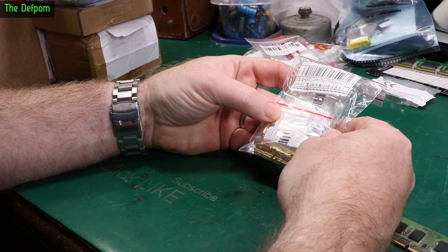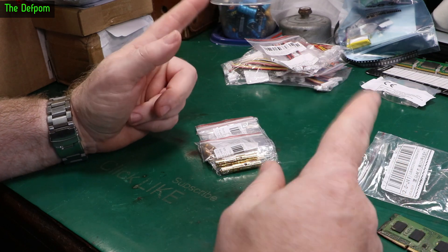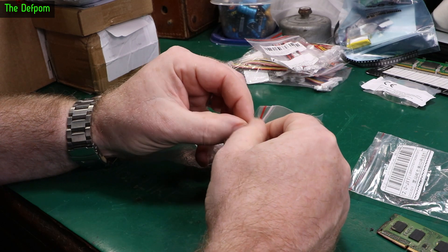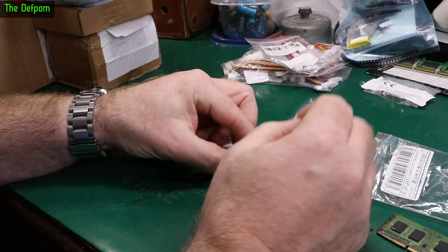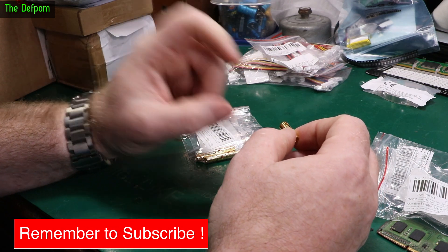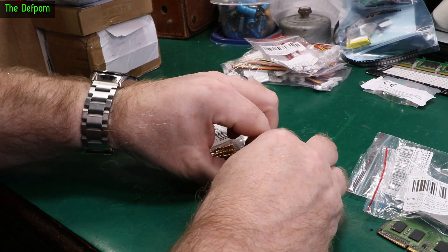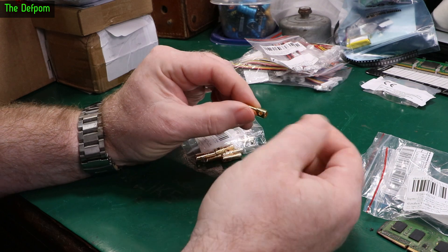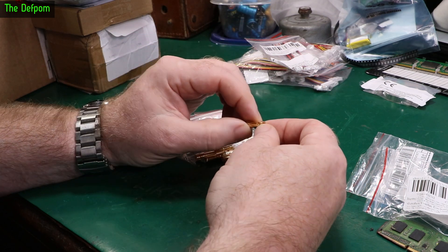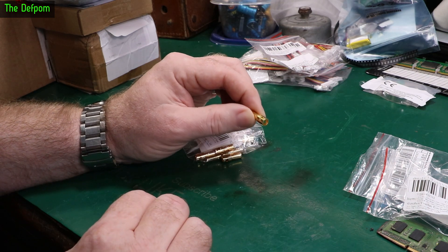Hopefully these are the right things — let's find out. Now these are needed for a bit of a weird situation. I've got a piece of test gear which I've done videos about — it's a capacitance standard, like a decade capacitance thing. It's got sockets along the front and they're not four millimeters, they're 5.5. They're actually shorting plugs, so when you plug something in, it shorts the terminals inside and adds that capacitance to the output of the unit. I had no plugs for it, and I think these will fit. Yes, these do fit — these plug in beautifully. The only problem is the sockets are quite recessed, so when I push this in it disappears behind the faceplate and I have to use tweezers to get it back out. The actual physical connection is good, so that's the main thing. I need to solder a piece of wire onto the back of them so I can actually use them as plugs.